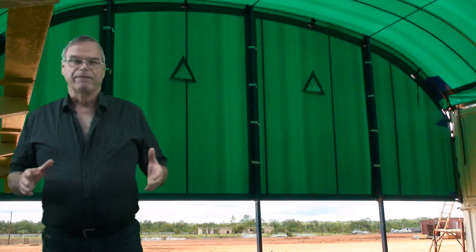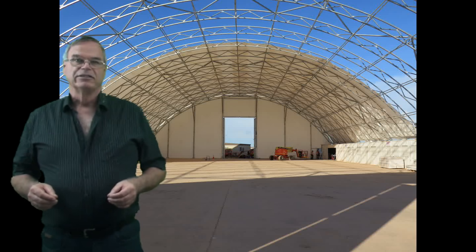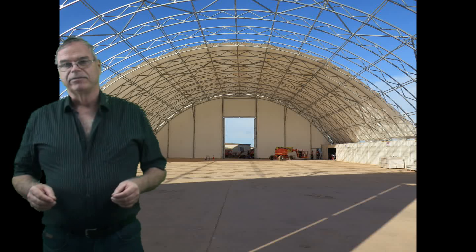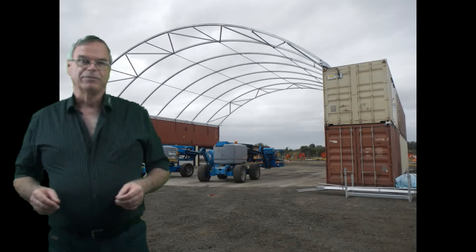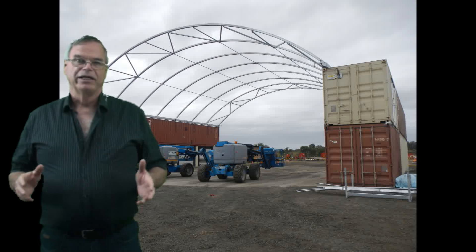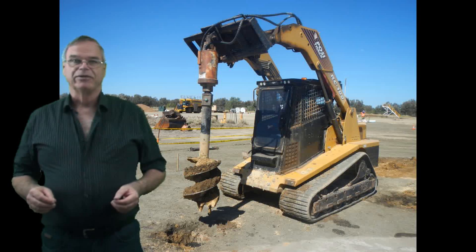With the end walls, they are expensive — there's a lot of steel in them and they've got to be wind rated. Sometimes it's worth making your structure an extra container longer — an extra 6 metres of container — so you've got a longer roof section to stop the rain coming in. If you work on about a 45-degree angle of attack of weather coming in, make sure that you've got plenty of dry space if it's going to be raining.